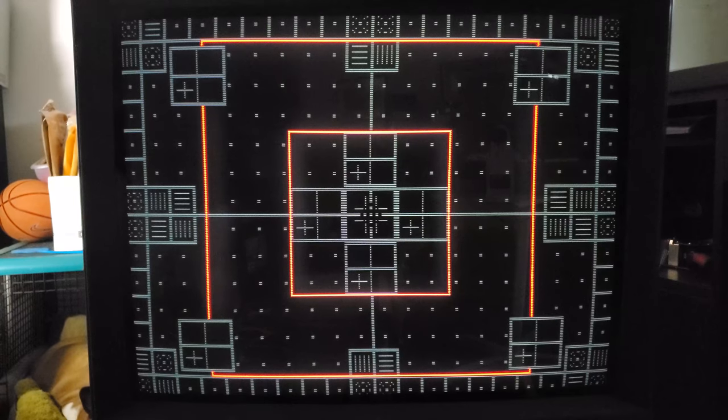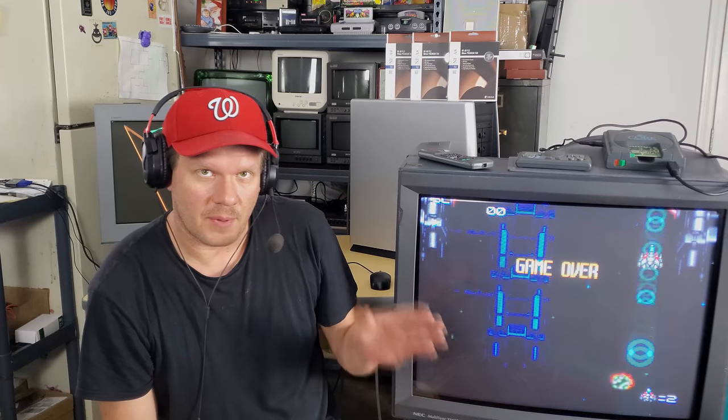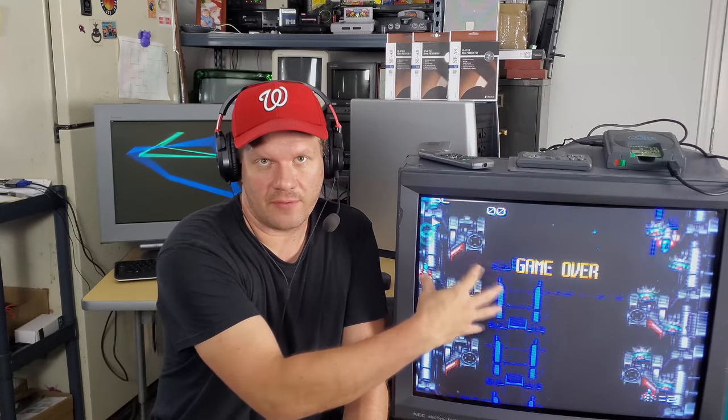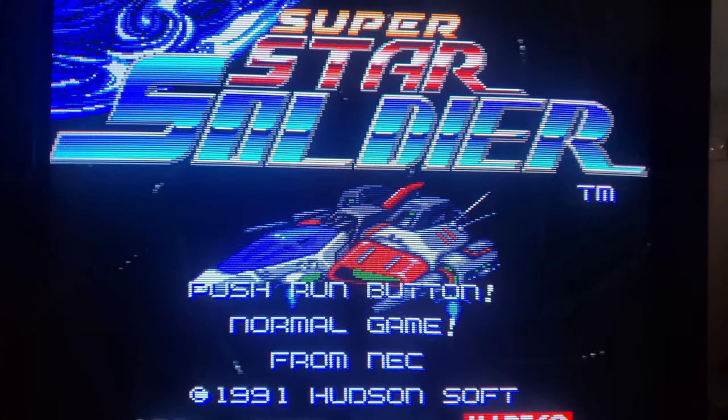It takes a little longer than it would with, say, a PVM, since you're scrolling through with just those two buttons. And there's not an actual number setting when you save it. It just goes by like a volume bar almost. So it's a little bit trickier to adjust geometry on, but it's still very doable. You can also adjust things like your screen tilt, so you don't have to worry about a yoke tilt on this CRT ever. It does have a very nice high-quality remote that gives you a lot of geometry controls, not all of them, but a lot of them. It also gives you degauss and volume controls. There are speakers built into this monitor, stereo speakers, and then you have the option to go stereo out.